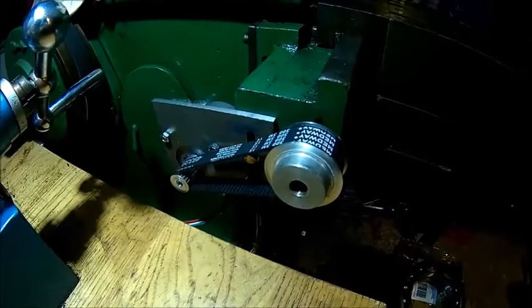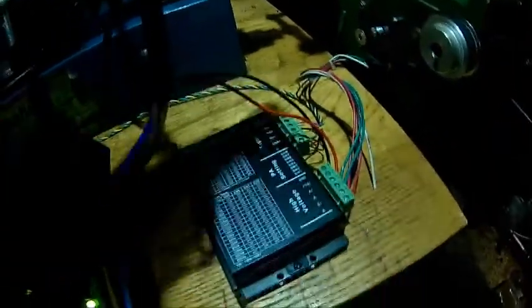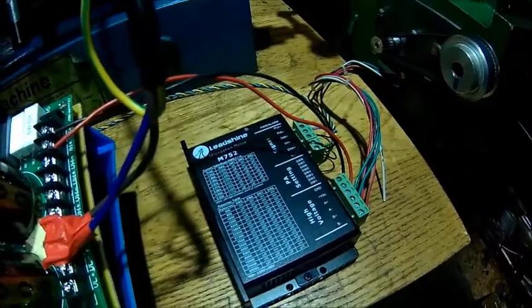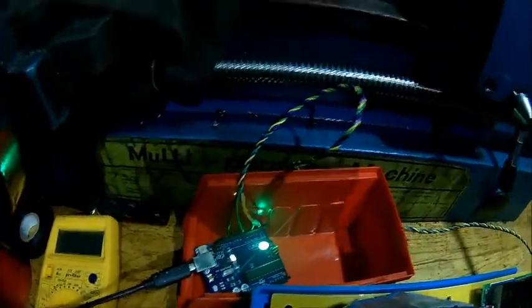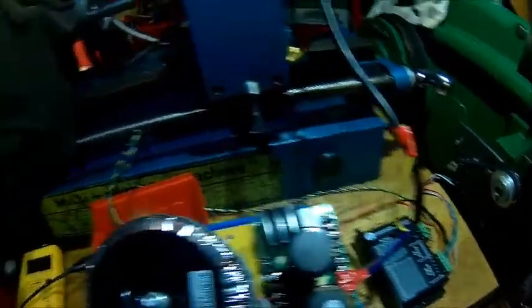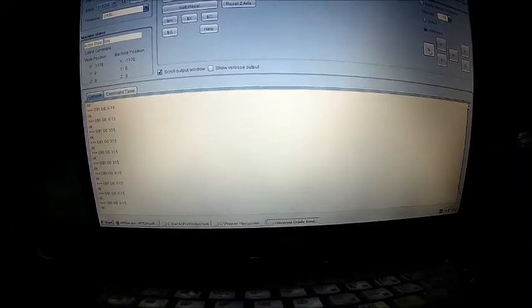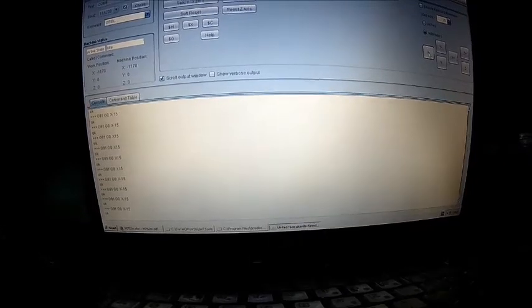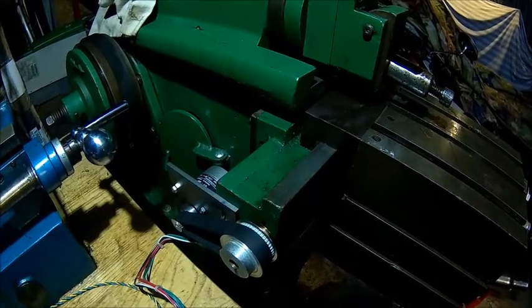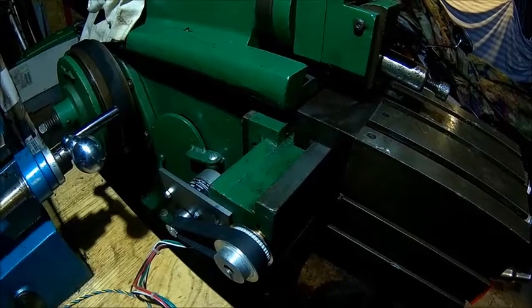Let's get on to the electronics. The setup is a power supply, a Lead Shine M752 stepper driver, and an Arduino running Grbl software. I'm not going to use that for the final thing — it's just easy because I have it and I can do the movements. The software we use for moving the whole thing is called Universal G-Code Sender. It's a Java application and you can freely download it from the internet — I'll put a link down in the description. The motor is just one I had; it's not the one I want to use at the end, but it's just for trying out a proof of concept.